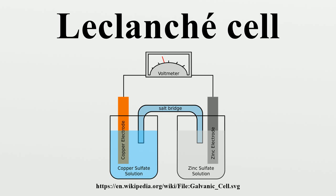The dry cell form was used to power early telephones, usually from an adjacent wooden box affixed to the wall, before telephones could draw power from the telephone line itself. The Leclanché cell could not provide a sustained current for very long. In lengthy conversations, the battery would run down, rendering the conversation inaudible. This was because certain chemical reactions in the cell increased the internal resistance and, thus, lowered the voltage. These reactions reversed themselves when the battery was left idle, so it was good only for intermittent use.